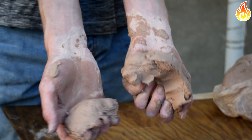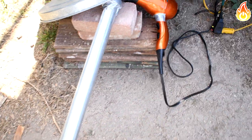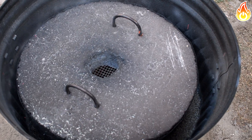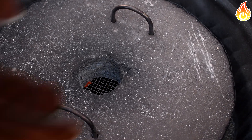I had a bunch of leftover dry stoneware clay that was perfect for this project. To get the furnace up to temperature to melt metal, we'll use a steel pipe connected to a hair dryer to force air into the furnace and get the charcoal burning really hot. Now that we've talked about the design and materials, let's get into actually building the furnace.